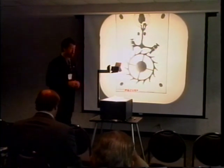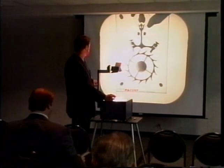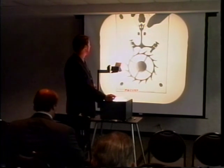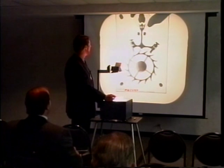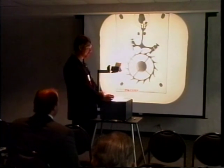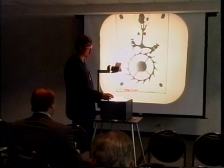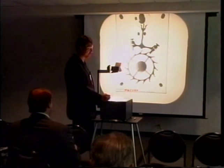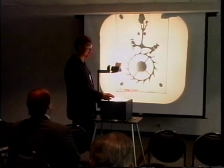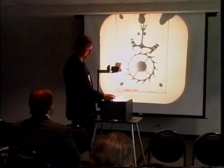Okay, now we wind the watch up, and the power of the mainspring transferred down through the train of the wheels causes the escape wheel tooth's impulse surface to strike on the impulse surface of the pallet stone, causing impulse to take place, which is the fork slot striking the edge of the roller jewel and causing it to be forced out of the fork slot on its mission of travel. And when the roller jewel stops at a certain point and comes back to the fork slot, what do we call this, the action here? What is this that we measure? What's that called when it's amplitude? Okay, we want to have a certain amount of amplitude.